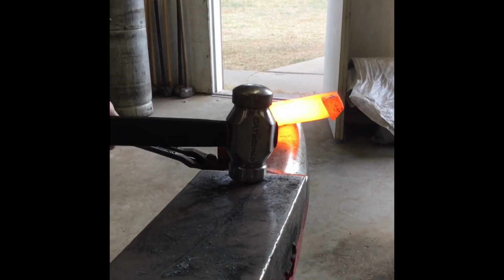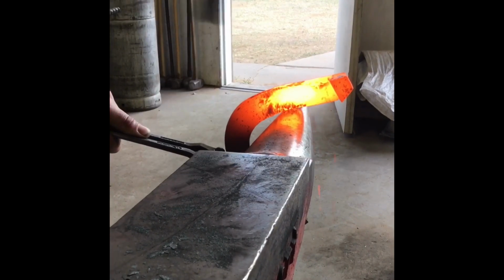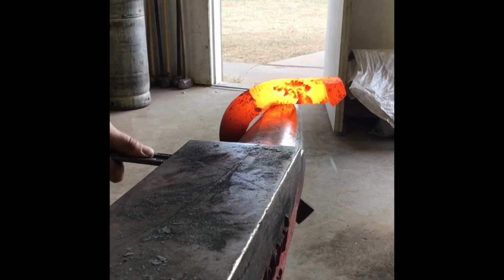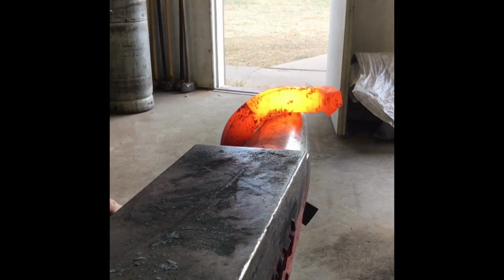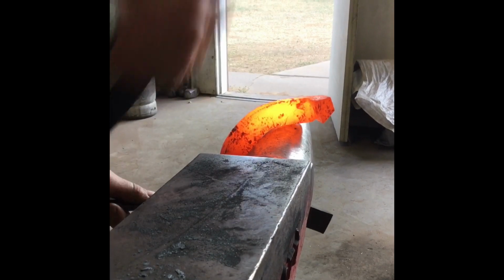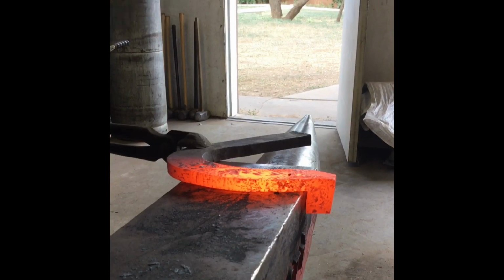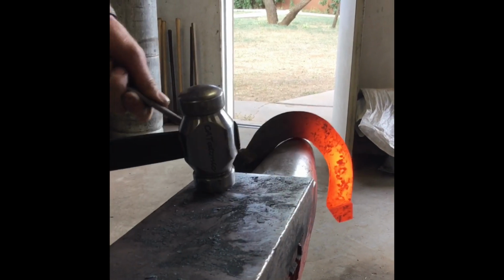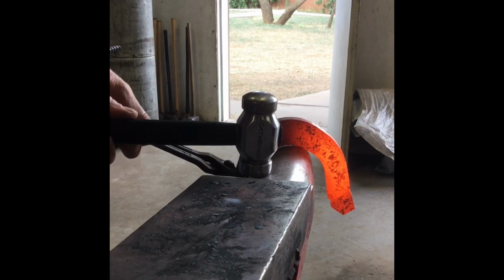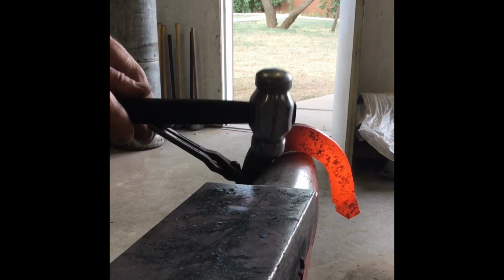All right, we're gonna put it where the heel nail is, and I'm gonna start bending it down. And I'm gonna overbend it. When I say overbend it, I'm gonna go past where I think it needs to be. And I don't wanna hit that edge of the caulk on the horn. All right, so then from toenail, I'm gonna go 2 points of contact out to the heel quarter and 2 points of contact to the edge of the heel caulk.